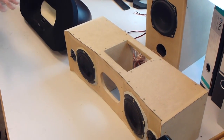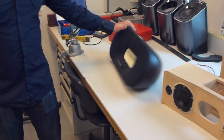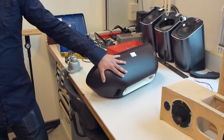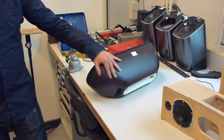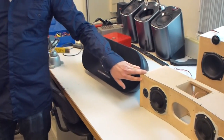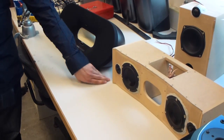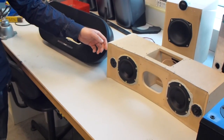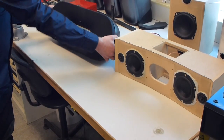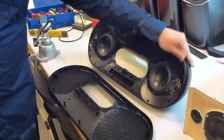When we moved towards the design of the final product, things like the rounded shape are there to minimize resonances in the case. What was clear from the prototype is that sharp edges caused issues — any sharp edge actually becomes a source of its own — and you want to avoid that as much as possible. So in the final product, all the edges are smooth.